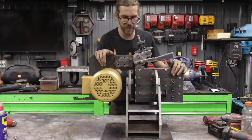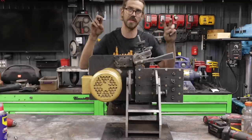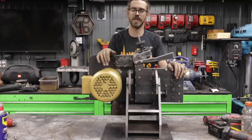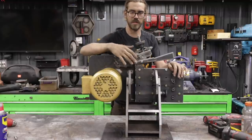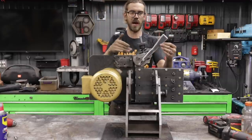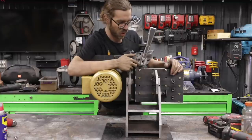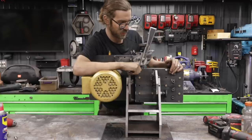What I will say about making this is the technique I used: I basically drew this out as a guess of what I thought the shape would be, drilled my center hole, and then tested it, and when the radius was incorrect, I either subtracted metal with the grinder or added metal with a welder to dial in this radius. When this doesn't work, you'll put it in a spot and it'll just flip over. The reason it does that is because the radius down here is in the wrong spot in perpendicularity, I guess you would say, to the pivot point.